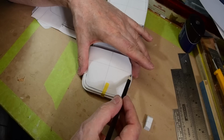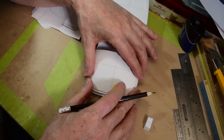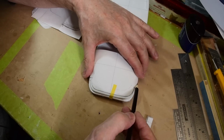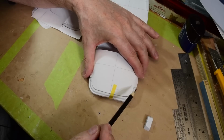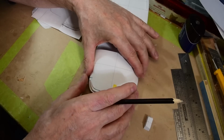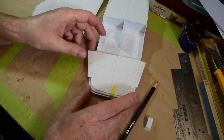And then once I'm happy with this fit, I'll use tape to fit it over the rear of the tug like this. And when I'm happy with it, I'll leave a little excess down here I can trim off later. Then I'll transfer this onto a piece of 15 thou, and then cut it out, and then just start gluing it in place and working it in, okay?